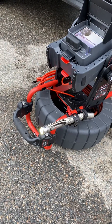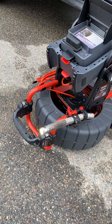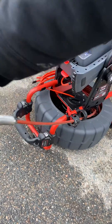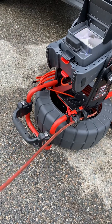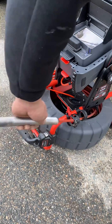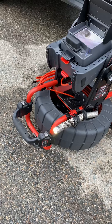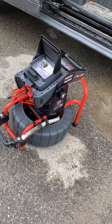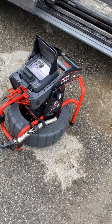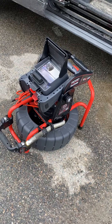This thing fits everything we need with that 130 feet. Everyone's asked what the difference between the M40 and the C40 is — they're the same design, same look, all the same features. The difference is cable stiffness. On the M40 the cable is moderately stiff, comparable to a mini reel. The C40 is comparable to a micro drain where it's a lot more flexible. The C40 would be better for two-inch pipe with a lot of bends.